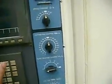This is the custom maintenance mode, so I'm switching off the hydraulic valves first, because what the PLC does is just de-energize the valves. When that happens, you can go back to the panel push button and reset the alarm. Then go back, and once you have cleared the condition, you can continue your pallet change rotation to complete the pallet change. There, it's done.